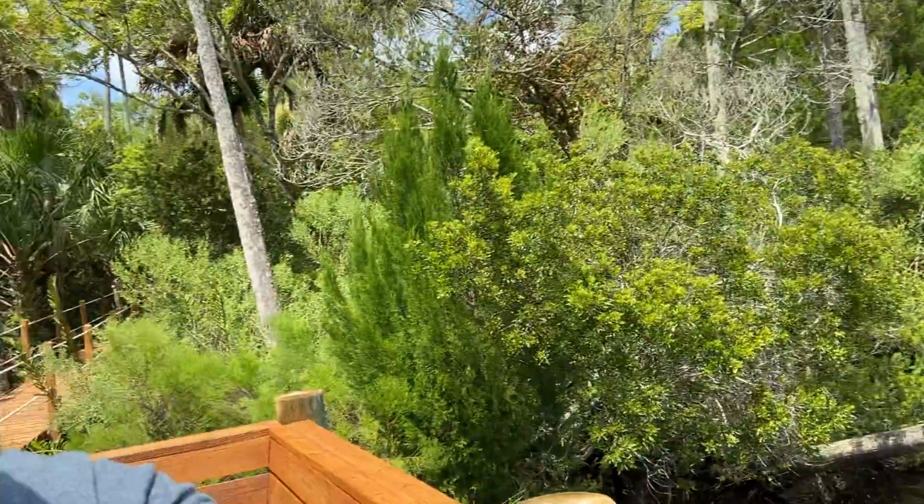I'm gonna cut this video short. Everybody have a great day. Thank you for taking a walk with me and seeing what a pressure cleaning, stain and sealing job looks like, and some of those tips and tricks in regards to not being sloppy with your work and getting stain on those nautical ropes by using that foam insulation and a 2-inch cutting brush, and also not attempting to spray those posts. The overspray creates drip marks and runs, and you risk getting stain and sealer onto the nautical rope, which would absolutely ruin all of your hard work.